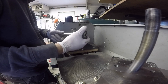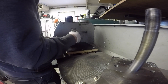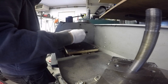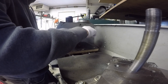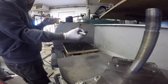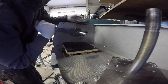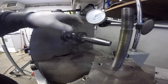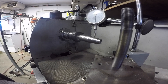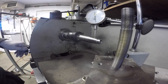Here's my MT4 to ER32 — the MTB4-ER32 adapter. Slide it in there — we want to go in about that far, no need to go in too deep. One thou on that part. Now let's move it out here to 30 — one thou. That is acceptable.